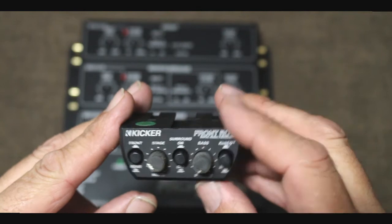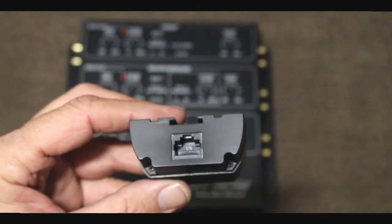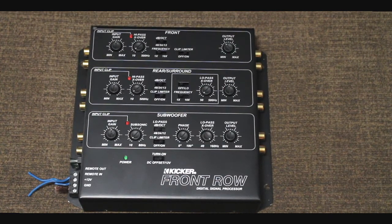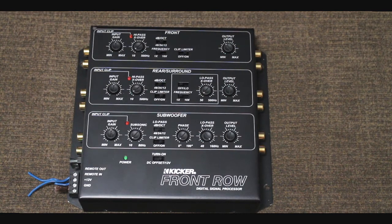If you're using surround on FM radio it sounds kind of wonky — it's just too much of an effect. Over here we have our bass knob, which is a two-step bass knob. There's a button for Kick EQ, which is centered at 45 Hz, and I believe it's labeled 0 to 11 but it's approximately 12 dB on the bass boost.